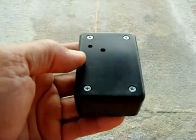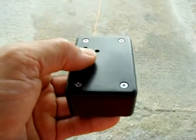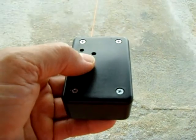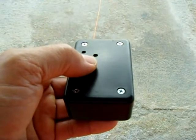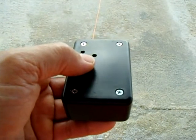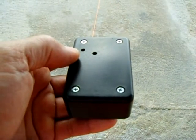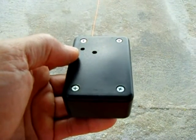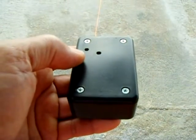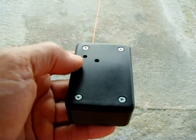This particular circuit is only designed up to 2 GHz. These two openings right here are trimmer adjustments. One of these is the tank circuit, which is the trimmer capacitor in parallel with the inductor coil — that's what sets the frequency. I added the other trimmer from the tank positive rail to ground because my board was a little unstable, but once I added it the circuit became very stable.